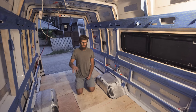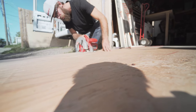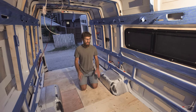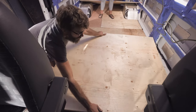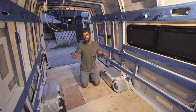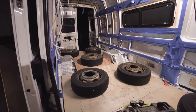We're putting down our second layer of plywood — we're doing two layers of 3/8 plywood to stagger our seams and make it more structurally strong. We're using standard PL construction adhesive to glue each layer of plywood together. Then we'll lay out some tires on top to add weight and leave it for a couple of days to dry.